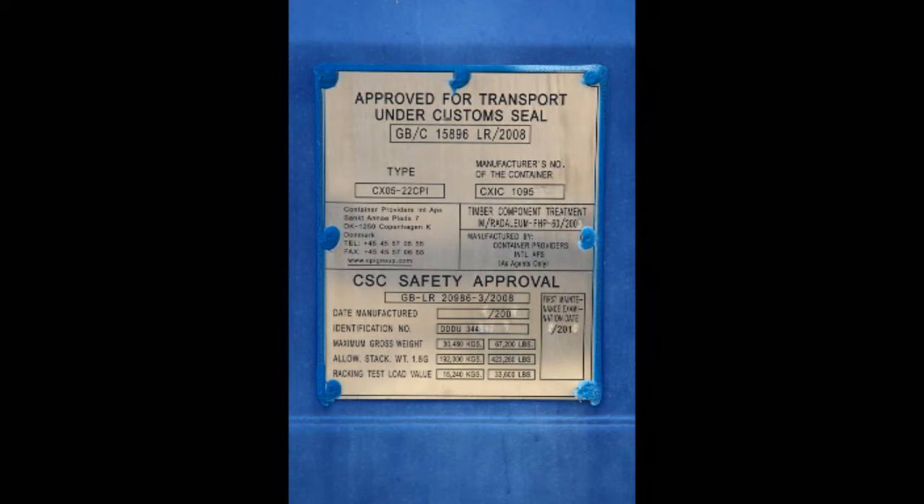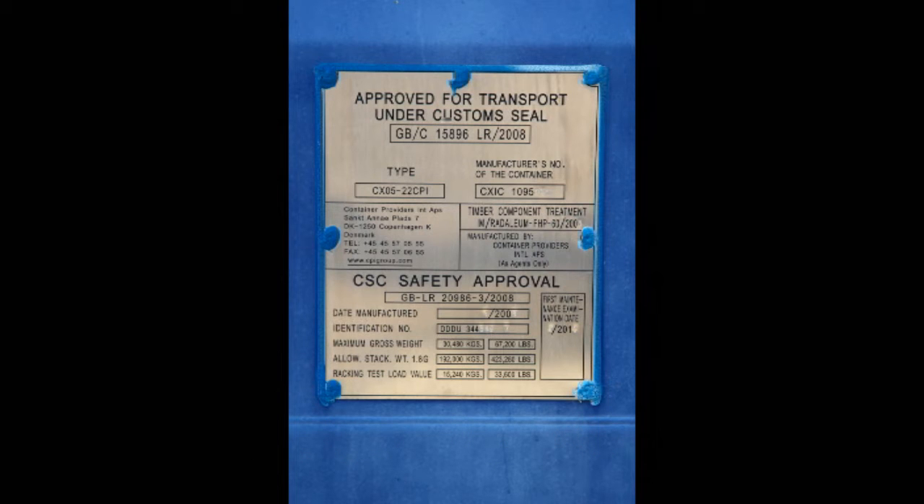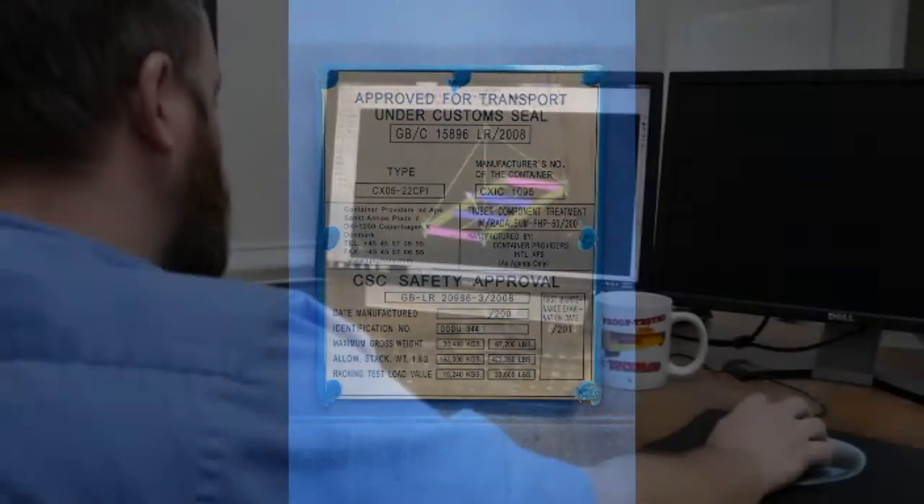Another precaution is to make sure that the container you plan to lift is certified as a safe container. Check to see if it has a CSC plate like this, which stands for Certification for Safe Containers. Storage containers may be weather tight but have been taken out of shipping service and should not be lifted unless empty. Storage containers are typically not structurally sound and may fail if lifted while containing a load. This could cause significant property damage and could easily kill someone if the container were to fall on them. Be sure the container you are lifting is structurally sound.